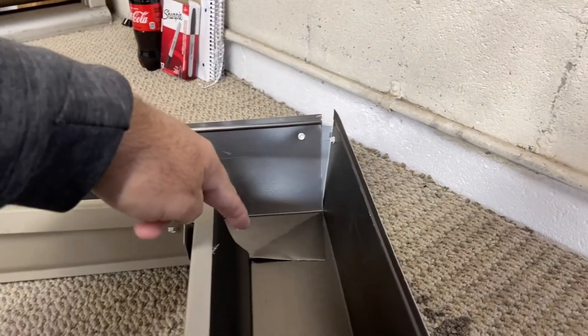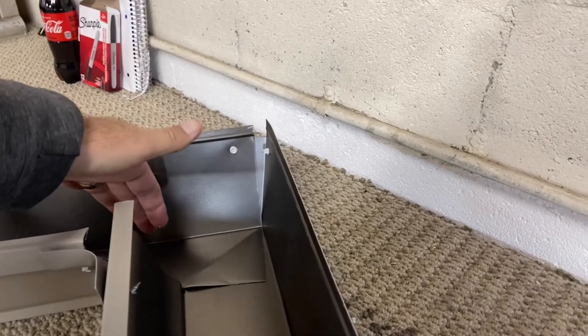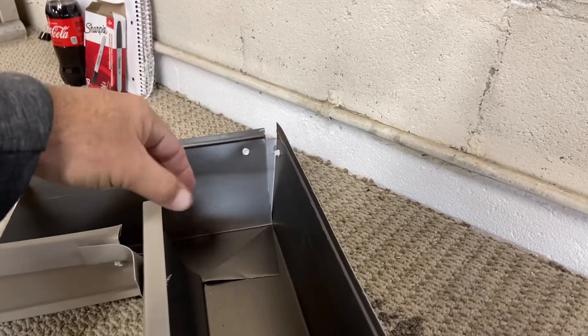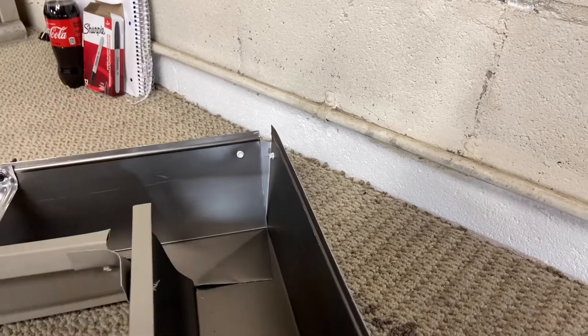You'll see how the tab was folded down, and that tab is there so that when the water comes out it goes around rather than inside of the gap that's in there. Whether it's a small hair-thin line gap — which in this case is very minimal — or not, give the water the best chance of getting out.